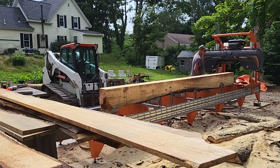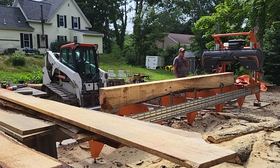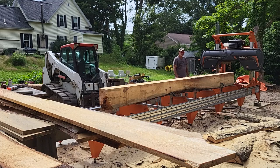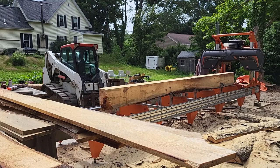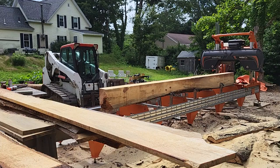Yeah, I'm still all in the heartwood here, so I think I'm gonna do that. I'm gonna take another board off this side. Then I'm gonna flip it all the way over, mill it to 8 inches. And where's my 8-inch scale on the side? Because I can make a mill line on the side too.